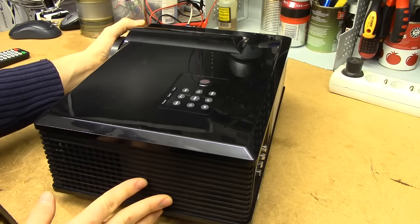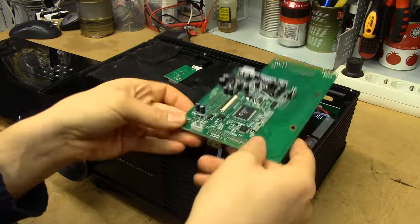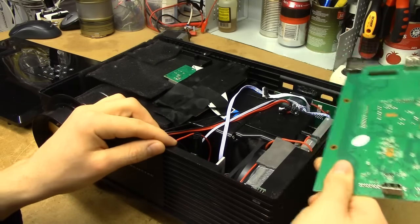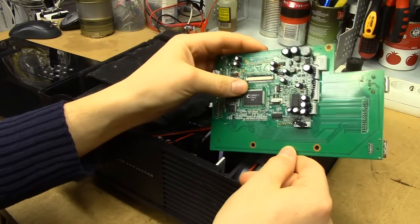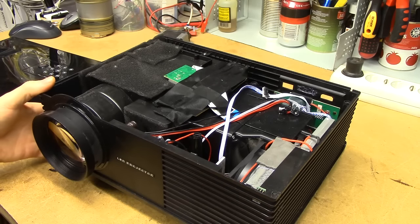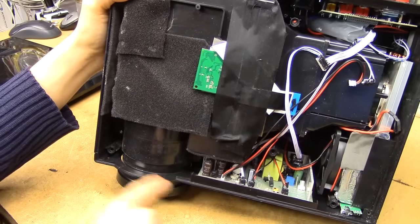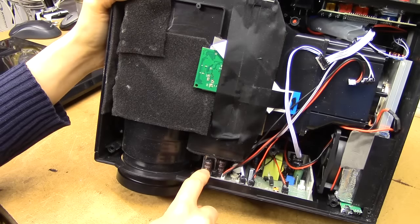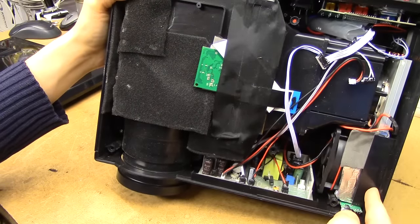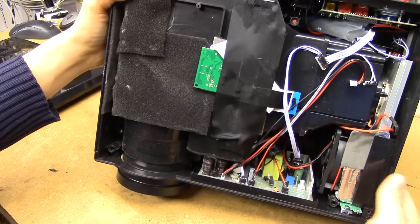Let's reveal the horror by actually lifting the lid off this thing. For starters, this board was actually quite well mounted into the device. I took it out in order to get a better look — it's got some processor going on, lots of connectors interfacing, and an HDMI extension which leads further down into the case. If we flip the unit on its face, we can get a glimpse of the LED driver, which actually seems to be of somewhat reasonable quality. And the LED heatsink module in the back here with its little fan and all the rest is just optics leading the light out of it.